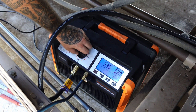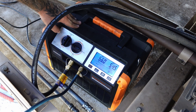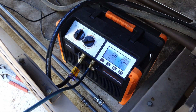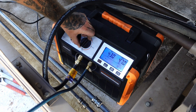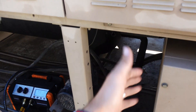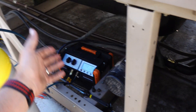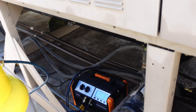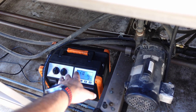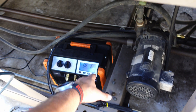Go ahead and move it over to close and then hit start, then open it up. There's liquid — okay, we've found our liquid. So this is where I normally pull from. I was nervous that because the feed valve wasn't functioning properly it might have caused the system to pump down slightly. That's not the case — because the valve couldn't open, it also couldn't close. So ultimately that left everything where it settled out in the system once the compressor turned off. We're moving pretty good. We got a little bit of a rattle but so far it's okay — that doesn't scare me. We're just going to let it roll.